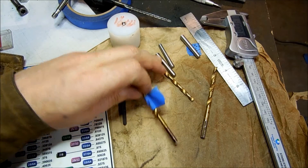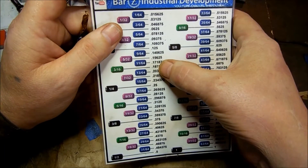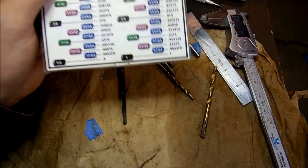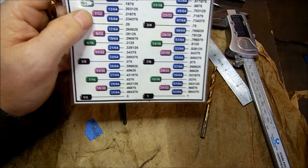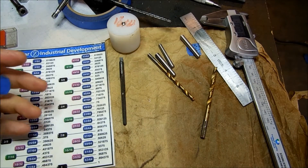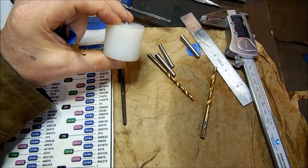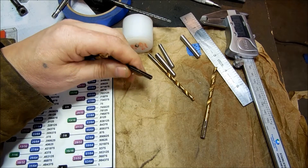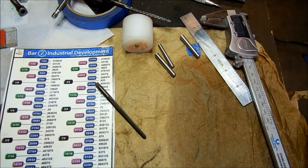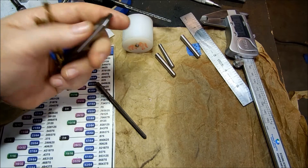That'll give us a hole all the way through at 171 thousandths. Theoretically it's probably got a little bit of runout on this drill bit. And then 13/64ths will be the top end, giving us 15 thousandths to ream. It worked fairly well once it started cutting, though there's no lubricant on plastic. I have some stress proof and I'm hoping that will give me a fighting chance. Let's go over to the drill press and chuck up our center drill.